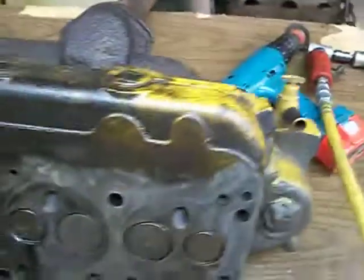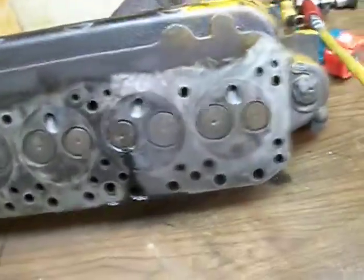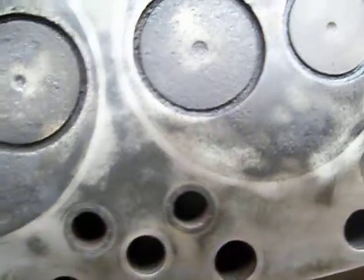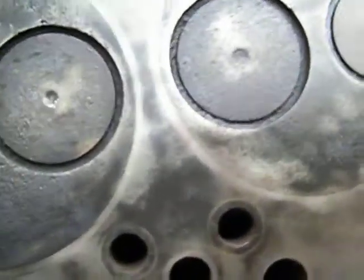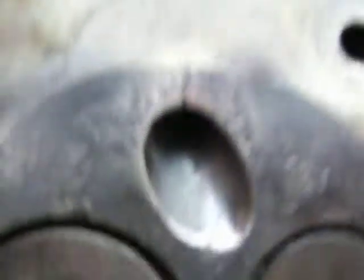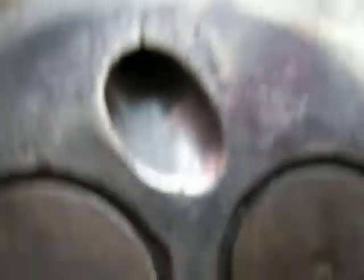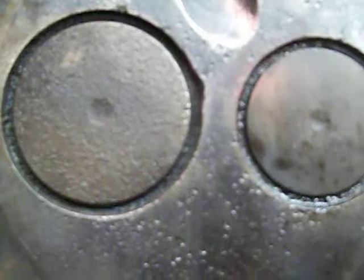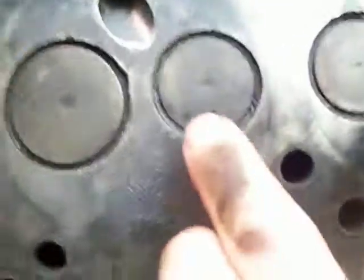So anyways, if anybody has any line or idea on a cylinder head as far as where I should go from here, I do know a couple of tricks to help keep the air pockets, gas pockets, from boiling up into the cooling system, but this has got so many cracks. I have a sneaky suspicion that it's probably cracked so far that there's exhaust passing into the coolant passages. At least that would be my best guess. And remember, this engine did have a burnt head gasket.